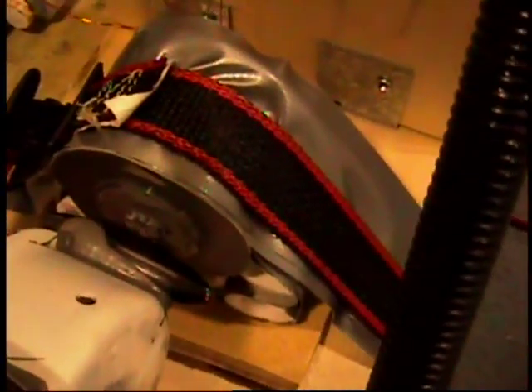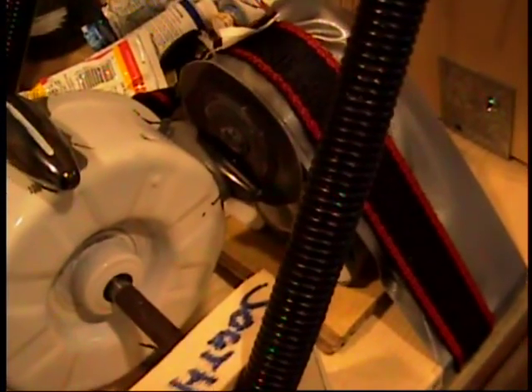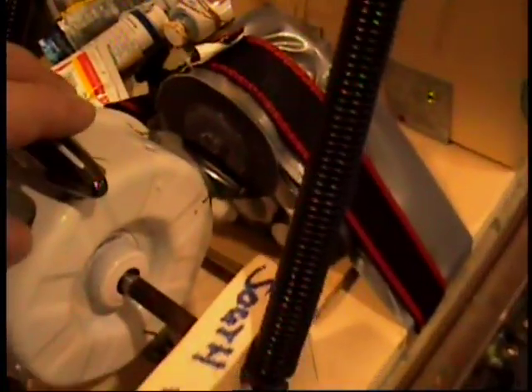So I have shortened my coil. It's over here attached to my machine and now it measures in at one and three quarters — almost one and a half actually. It's wrapped in duct tape right now and held down by a cabinet strap just to hold it still, and I built a little platform for it. Just by shortening the coil — using the same wire, the same length of wire — I just took it off of the carriage bolt and put it onto a much shorter, squatter core.